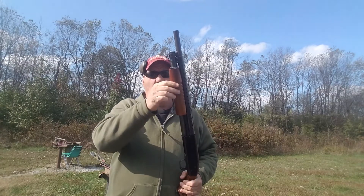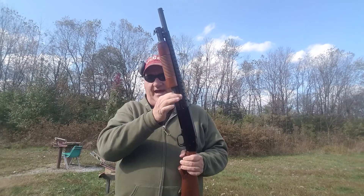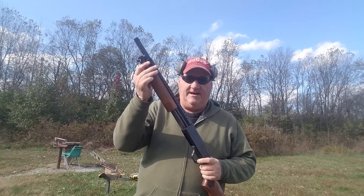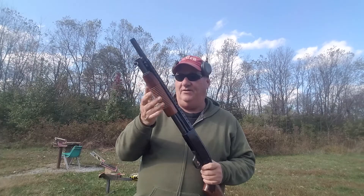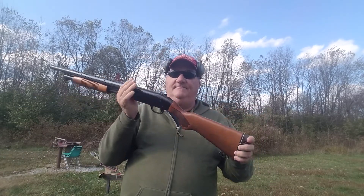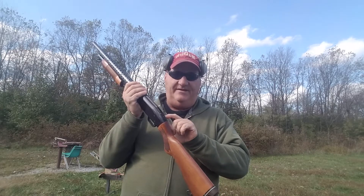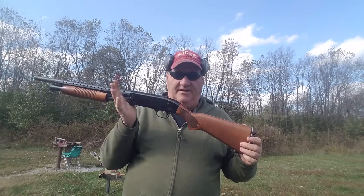The Mossberg's forearm carrier — the part underneath the wood — is a metal tube which the action bars are attached to. It's all metal and it's got a collar that holds the forearm in place. That simply screws on and tightens the forearm up on this metal piece underneath. Then there's the safety, up here on top, and this slot has to be milled in. The piece that constitutes the safety inside, which blocks the action, is a milled piece of metal.